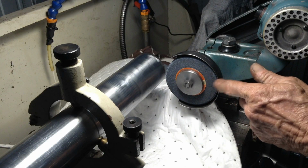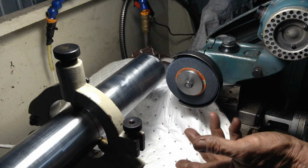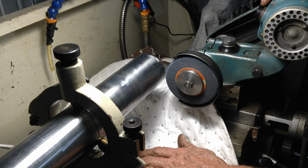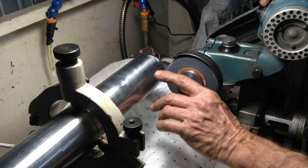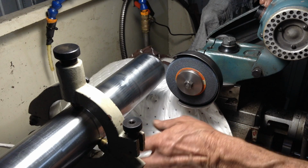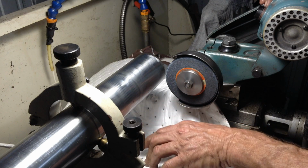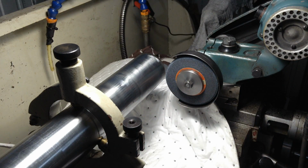Okay, this is our Walden Type CO little tool post grinder. So one important thing when you do use these on a lathe is you really cover all your ways, cover up as much as you can, and you'll be fine. You won't have a problem with the grinding dust. Now I do normally run coolant, and that's why I use something like pig mat or rags on top of rags, and that'll filter out the bulk of the grinding dirt material, so it doesn't get mixed up in the cooling system of the machine.